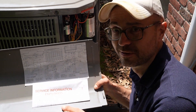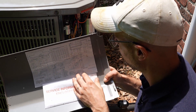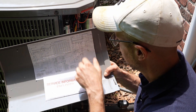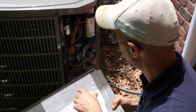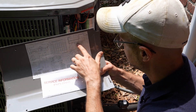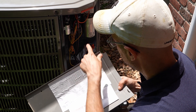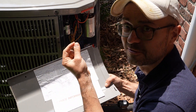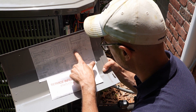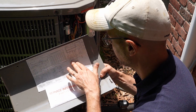If you can't read a schematic, you should not be doing this. But even so, this is a super simple system. Basically, this whole unit just consists of two components - the compressor and the fan motor, both of which are right here. This dashed-dotted square represents what's inside this panel enclosure. Inside here we have three components: a capacitor for the compressor, another capacitor for the fan motor, and the relay that closes and opens when the system starts and stops. The schematic even has a hypothetical start kit that you could wire into it, though it's a different start kit than what we're dealing with today.